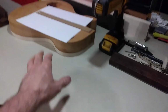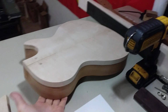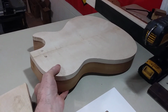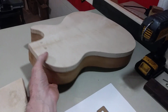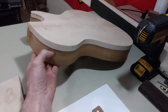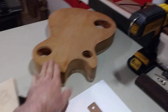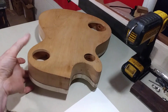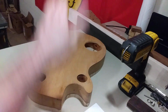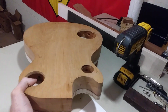So now when you're building it, you have to put the epoxy on the mahogany and then do all the clamp up from the front. You can see where I had the screws in there holding it together. But as soon as I got it glued up, but before it could squeeze out, I flipped it over. And even as I was building it, I made sure that if I was using a C-clamp, I put my C-clamps in where everything was tall on this side, so that when I finally flipped it over, I'd only have to block it up maybe about this much.